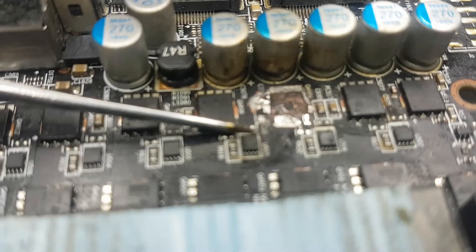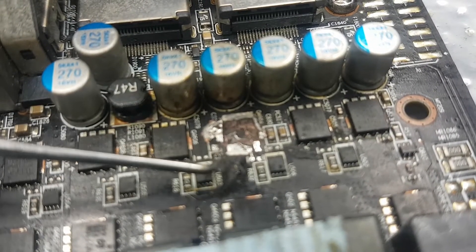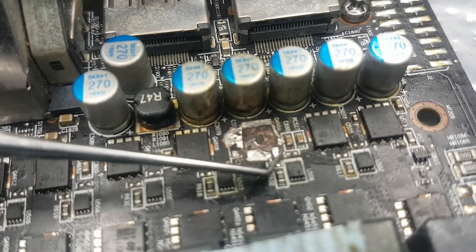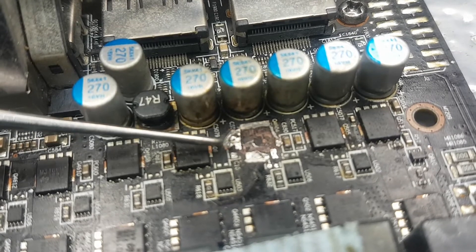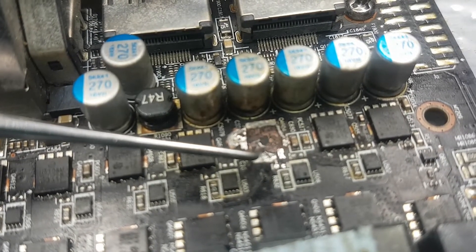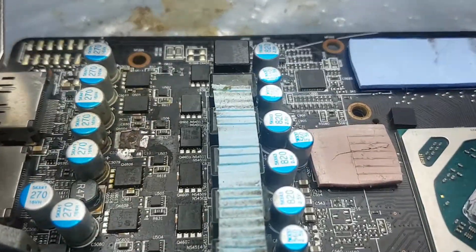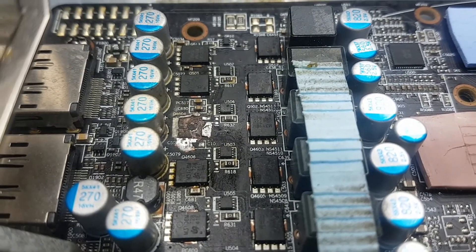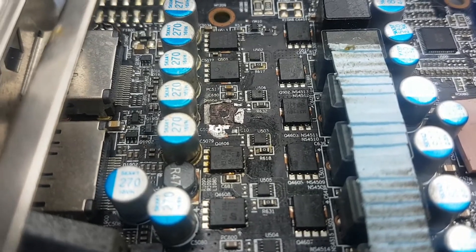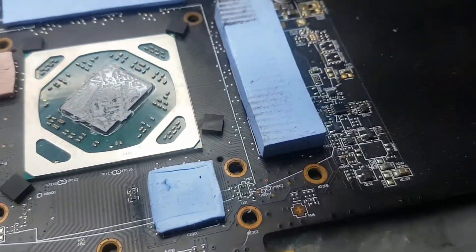After finally getting the exploded MOSFET removed on this RX 570 4GB card, you can see there's quite a bit of damage in the area. It was very difficult to remove this component. There's explosion damage exposing bare copper, so I had to add a little solder to help reflow it. The damage has gone right down through one of the layers of the card. Even after removing this component, there's still a short on the 12-volt rail. We're going to deem this card a no-fix — there are potentially many blown components and the board is damaged and not repairable. This board will become a donor board for future repairs should I get another RX 570.